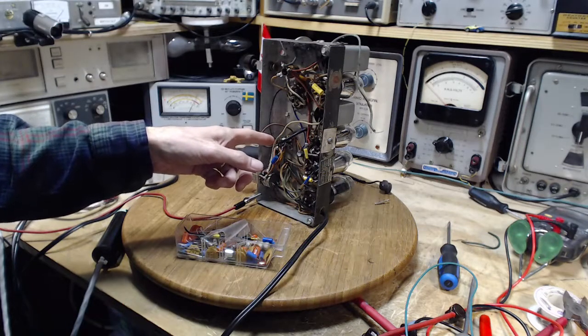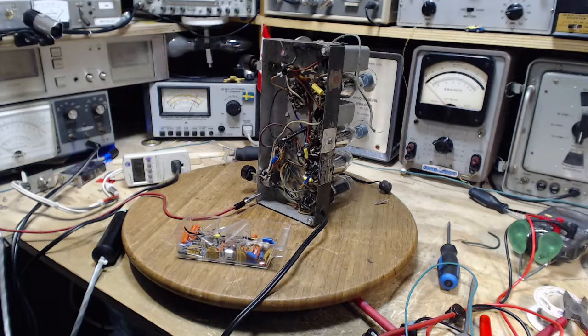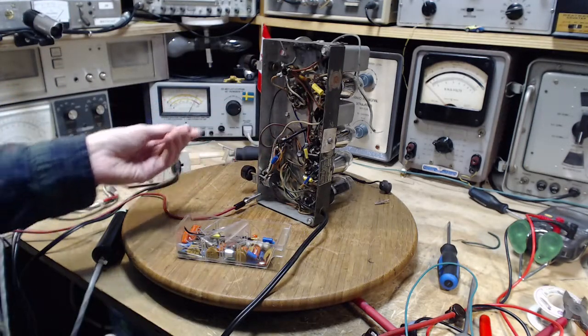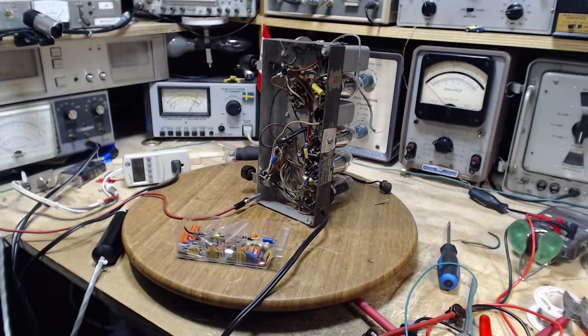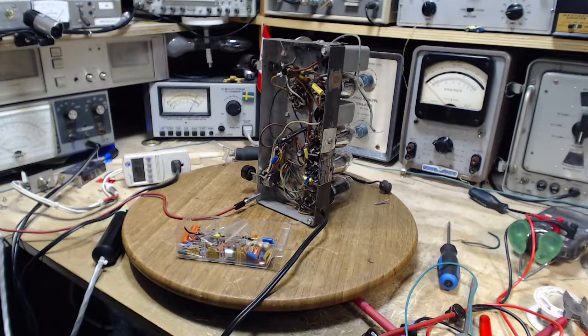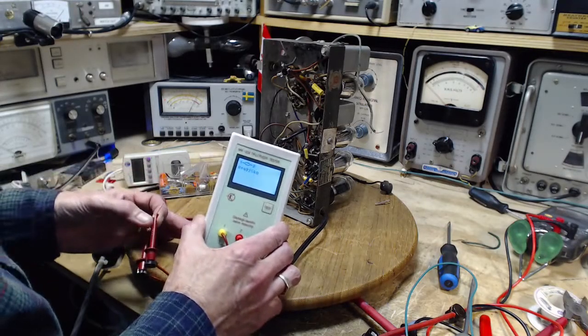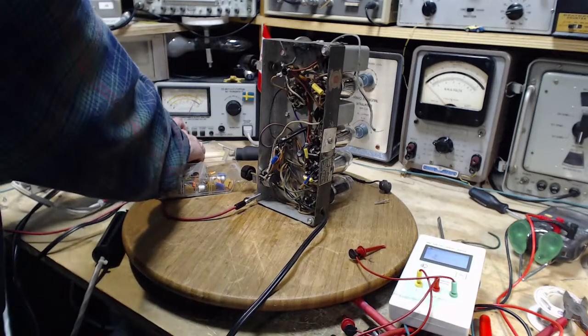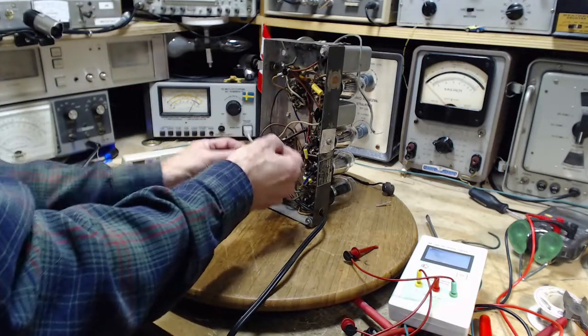What if I drop this from the 10 megohms to a 1 megohm resistor? 1/10 as big. There's a bit of a voltage divider with the volume control. I'm thinking too hard. Let's just do that. I'm just going to parallel in maybe instead of a 10 megohm, maybe a 5. Maybe we'll cut it in half. Now put a 5 in parallel with it, and then we'll end up with 3 or 2 or something like that, and see what that does. I gotta find one now. Okay, so I've got a 5 megohm resistor here. I want to bridge it in there kind of temporarily.